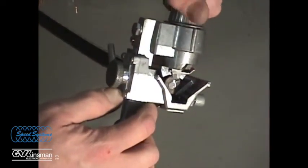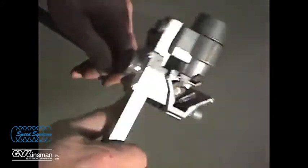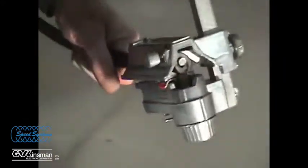Rotate the tool clockwise around the cable to ensure that the blade will not hit the conductor at any point. Set the strip width to spiral down the cable and strip the insulation by applying a small amount of pressure into the cable while rotating the tool counter-clockwise.